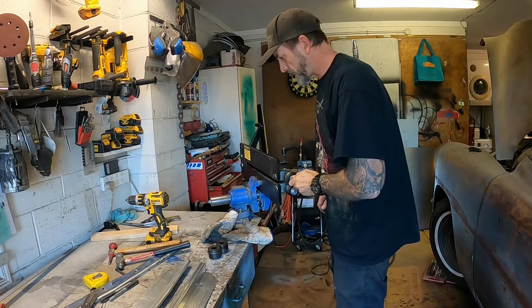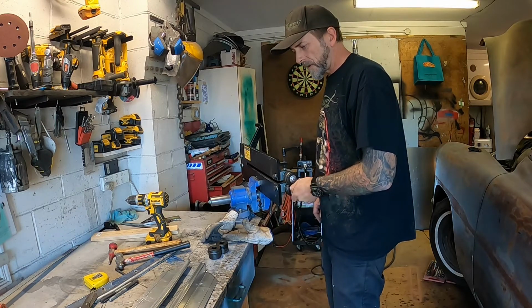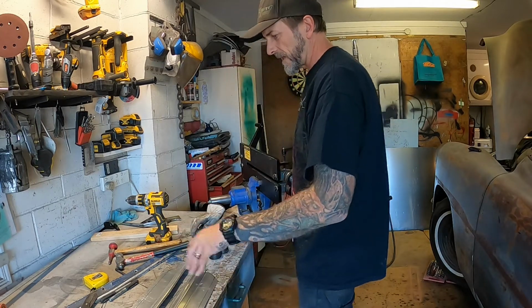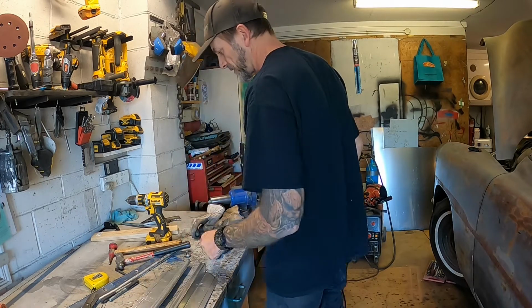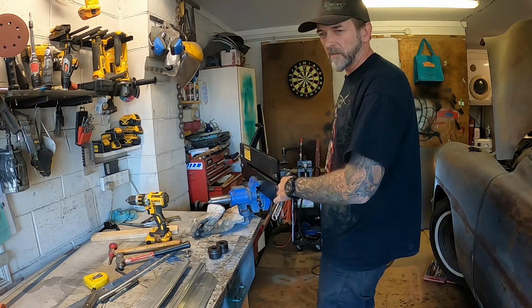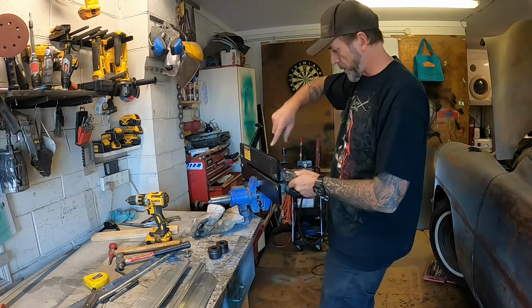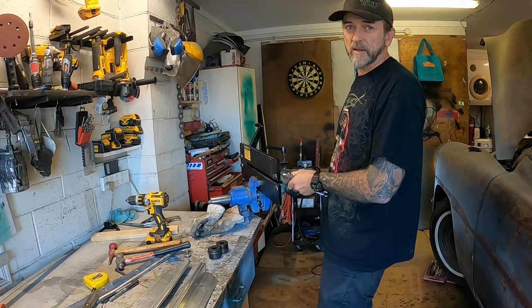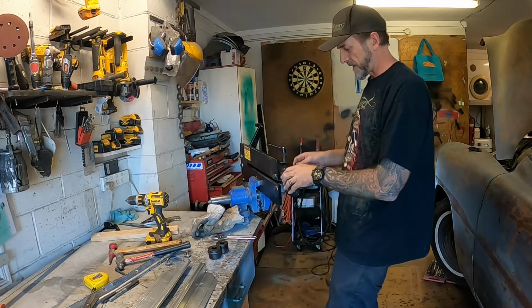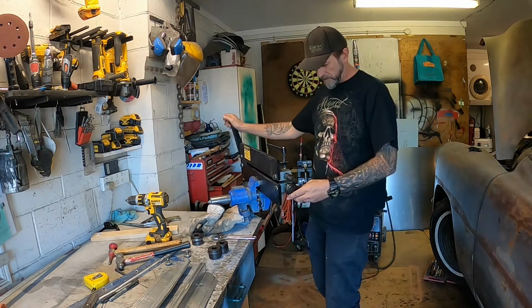Okay, update. I have, as you saw, marked out my final trim, and I've decided I'm gonna do a bit of a bead roll across that leading edge like the factory one, but I haven't got anything that fine like the factory one, so I'm gonna go as fine as I can go, but maybe just not as much pressure in there, if you know what I mean, like fewer wind downs. So I have to count them off to get them both the same. I think it'd be really cool if they had a gauge that told you how much pressure was on your bead roller.